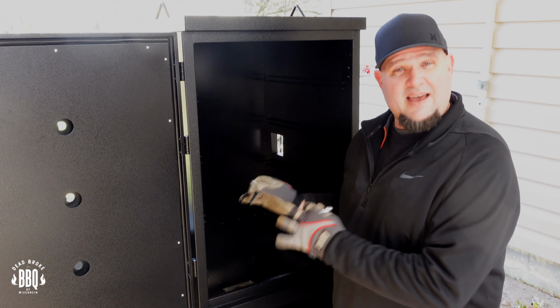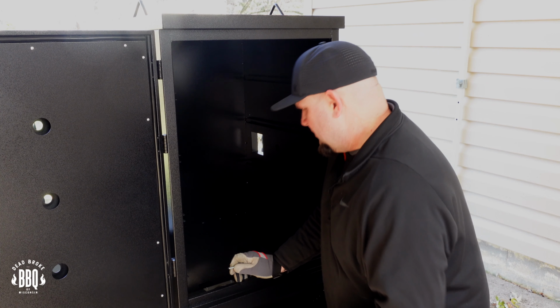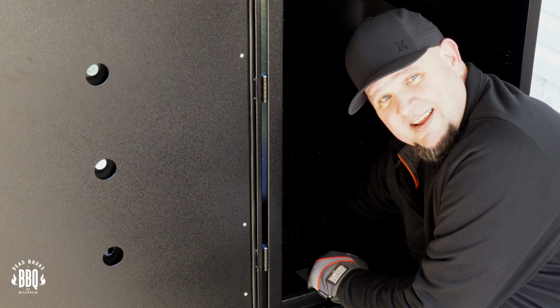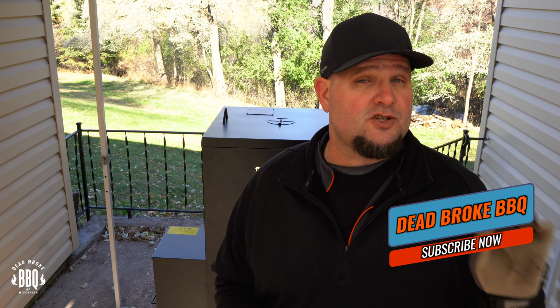Unfortunately, I don't have a lot of light down here to show you inside the vertical where these bolt holes are, but we'll try to show you right now. Hopefully it'll come out on the camera that you can see there are a couple bolt holes down here. The one good thing on the hopper, they are pre-threaded nuts. All right, I got this one. First try. Putting on that hopper is not the easiest task, but just be patient and make sure that you do not cross-thread those bolts.